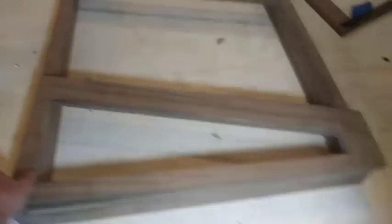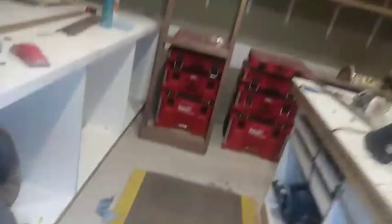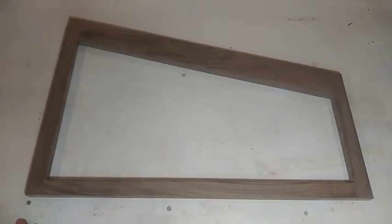Getting ready for a top coat of lacquer. We have more of them over here — that one is getting some epoxy on it to fill a crack. More face frames. We have three of them over there, one on the workbench, and three more face frames over there. For those who don't know, my style of really strong cabinets are actually made in two parts. The first and most important thing that gives it the strength is actually the face frame — this is what the doors are going to be attached to. If you're looking for really strong cabinets, make sure you look for something with a face frame.